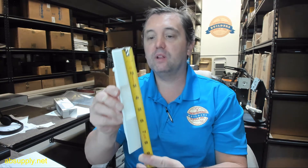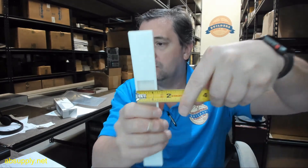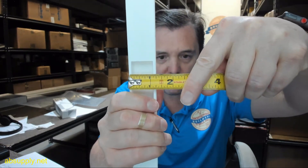You can buy individual piece parts for these Adams Rite locks, and that is a reason that I am partial to them. The overall height of the faceplate is 8-7/8 inches; the overall width is about an inch and a quarter.